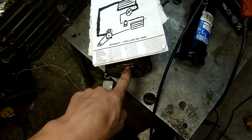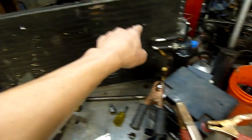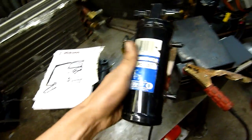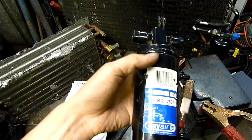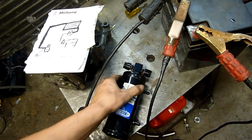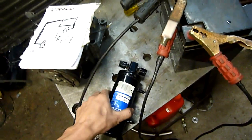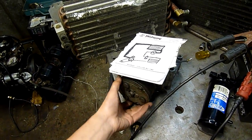You've got an engine-driven compressor, which is that; a condenser coil, which is that, in the front of the car in front of the radiator; and a receiver dryer — instead of a filter dryer — which is that. It's identical to that one basically, the same product, just this one's new. It contains a desiccant, a filter screen, and a volume to collect liquid, so excess liquid can just fill up in here. There's a dip tube that allows liquid out through the bottom of it.